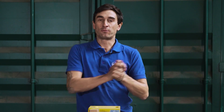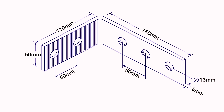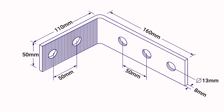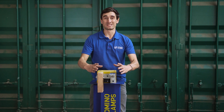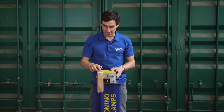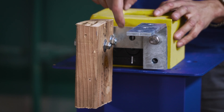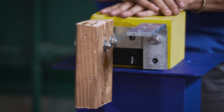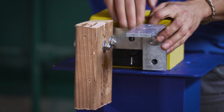These have been designed with four inch and six inch timbers in mind, though other sizes will happily work as well. Please follow the link in the description for this video to find full technical drawings showing you where the holes will line up with the timber sizes you want to use. For longer term installations, especially when using larger — say six by six inch — vertical timbers, I personally would recommend rebating holes for the bolt heads going into the domino clamp, so that those sit nicely inside the timber and the whole timber sits flush up against the bracket.